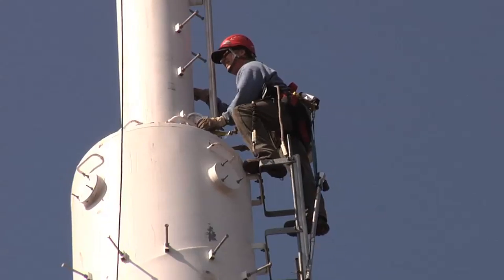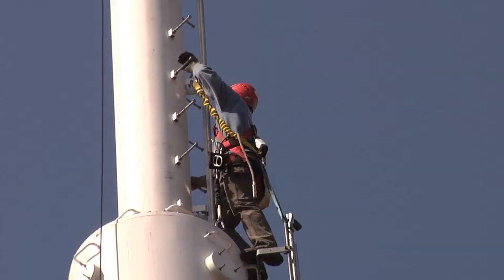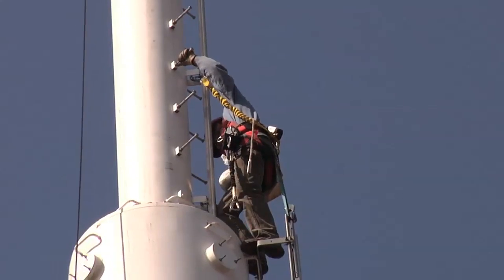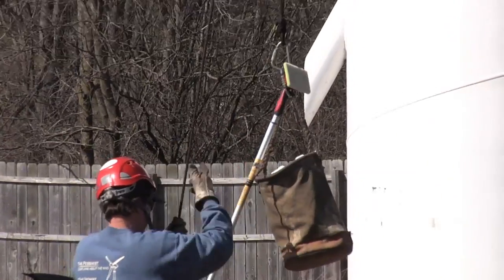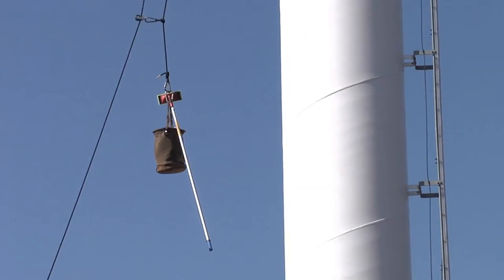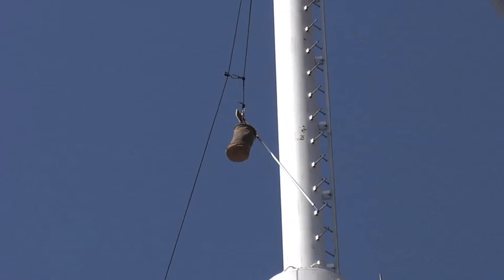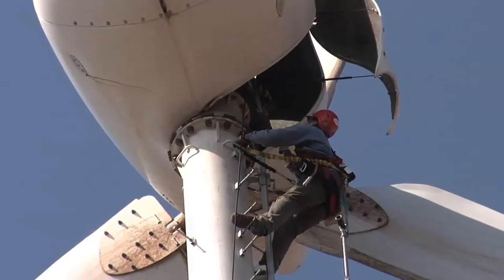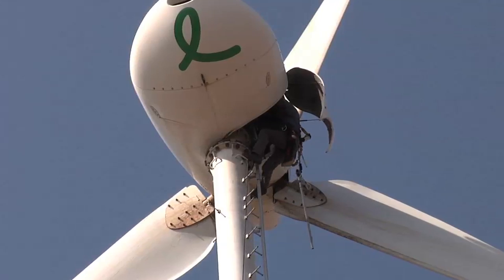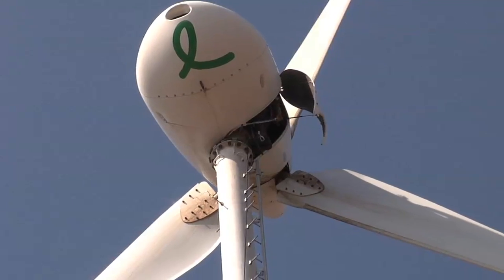Brian's up there right now — he's done the brakes. I'm down here helping as control, turning power on and off for him. We make sure we've got all our tools up there that we need first. He's going to send a few things down, then I can go up and we're going to do some more greasing, turn the blades a little bit and clean them — that's about the extent of it up in the nacelle. Then we're going to start working our way down and checking torque with a four-foot torque wrench at the tower levels.